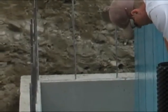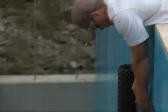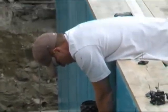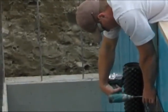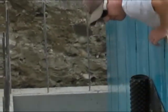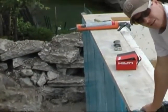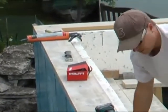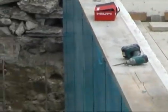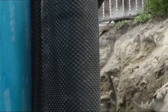So what would you say are our advantages to using your blue skin system and Super Seal combination over using an EPS-acceptable spray-on? I find that the spray-on membrane could possibly work if protected. Right. So if you use it in combination with Super Seal? Yeah, exactly. Okay. So you're overlapping about a foot and then you're going to screw in the joint into both sheets? Yeah, that's correct.